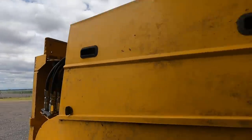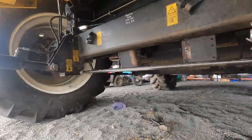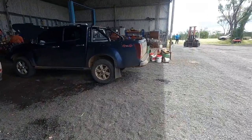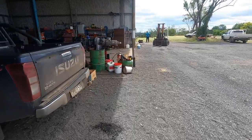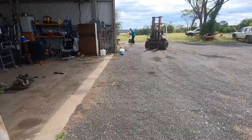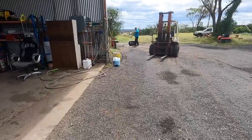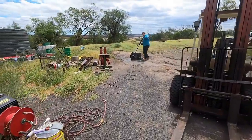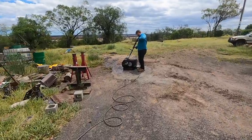Header number one was very black oil in the ground drive transmission, and as you can see, it's being pulled out. There's Josiah. There was a heap of metal in the bottom of it, and he's blowing that, cleaning that out now. And we have found the problem.